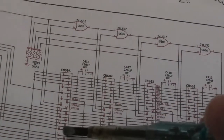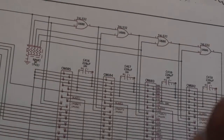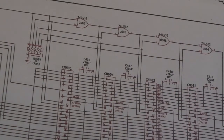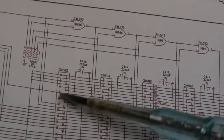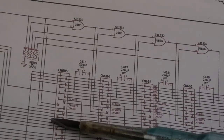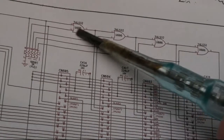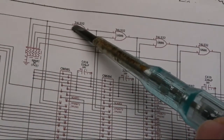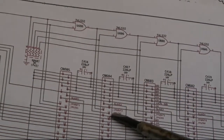It either tells the card to shut up because it can't deal with it, it can't allocate that space. You've got too big a card, you've got 8 meg and we've got 4 meg space left, etc. Or it's a 4 meg card and we've got 4 meg space, okay. But in any case, after it's finished that process, the config out pin on this slot then goes low. And because it goes low, if you follow the chain up here, where we originally had a high coming across here from that config out, now this low signal coming here, because we've got a low and a low, this drops low, which means the next slot is selected.